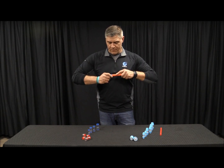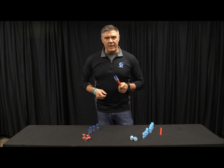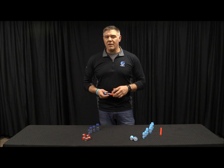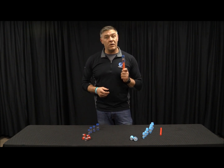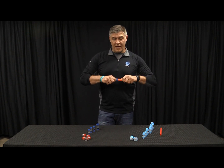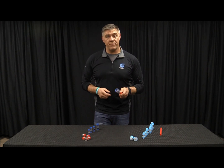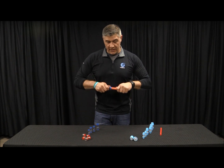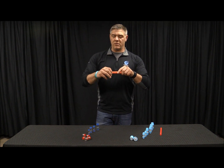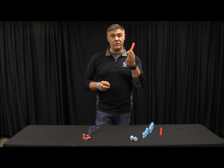When you go to put the coupler onto the duct, it holds very, very nicely. It uses a bite ring, but that bite ring is metal. We wanted to make sure that if you're using these in the field there could be no deterioration in the coupler — we don't want any water getting in there and possibly compromising the coupler. So we've tried to turn this into more of an indoor application coupler. The nice thing is it's very easy to work with. It's got a bite ring and a seal, and if you want to take the coupler off, all you need to do is grab the ring on the outside and press in and it comes right out, which is very, very nice.